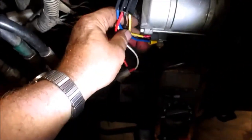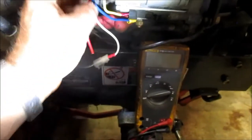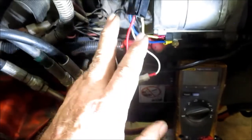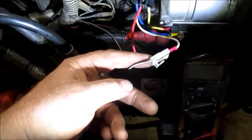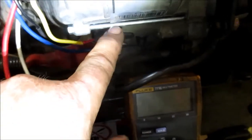I got carried away wiring and didn't pay attention that I wasn't recording. So let me show you what I did. The white wire to this standard automotive relay is coming from the key switch and all through all the safety switches and everything in the tractor. So what that means is every safety switch is still intact and operational. I haven't bypassed anything. But I am using that wire there to trip the relay. The black lead of the relay I'm taking to ground, and I'm grounding it right here on this lug of the starter solenoid — I've actually mounted the relay to the starter solenoid.